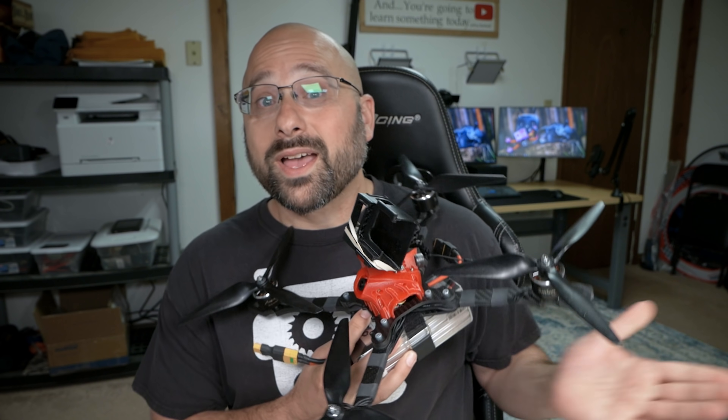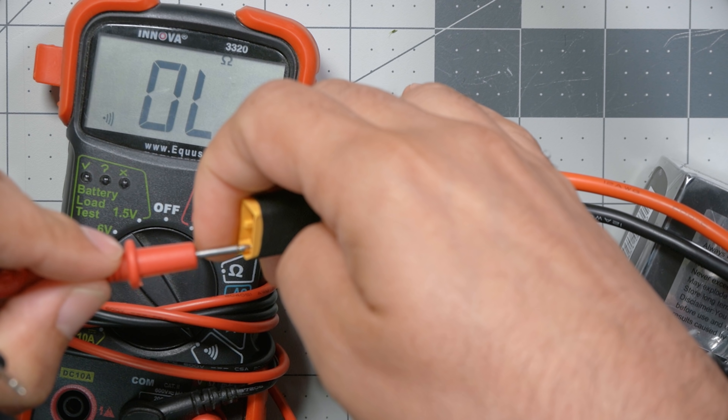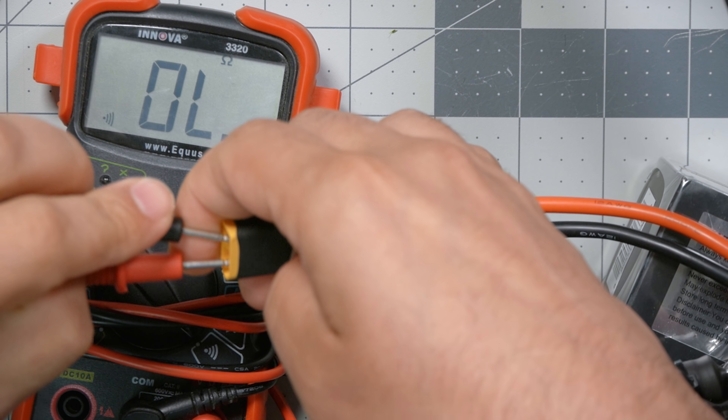Buy the right wattage bulb, or just buy one of the solid-state ones — they're more versatile. How do you know if it's safe to plug your quadcopter in? If you plug it in and it goes doo-doo-doo and then shuts off, chances are if it was going to smoke, it would have already smoked before the ESC got to the startup beeps. If you plug it in and it just immediately trips, that's pretty likely to be a fault condition. A good test is to get your multimeter out and measure continuity between the two prongs of the XT60 — if continuity is there, you have a fault.